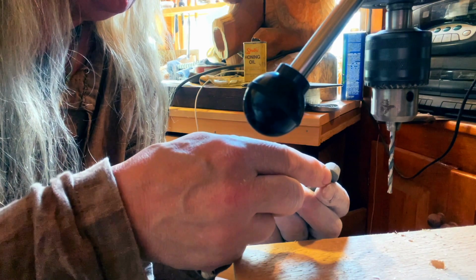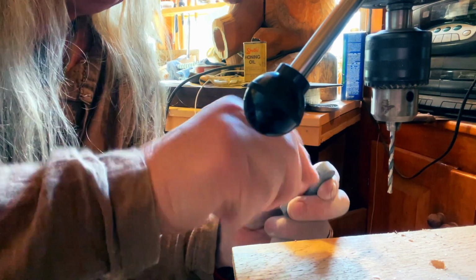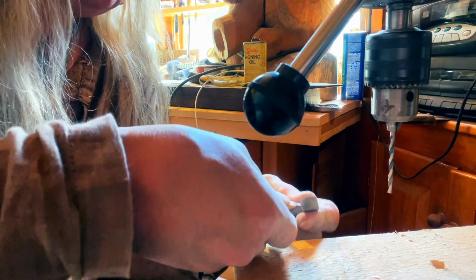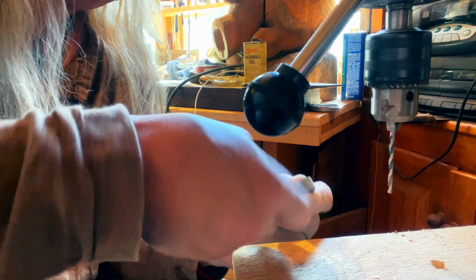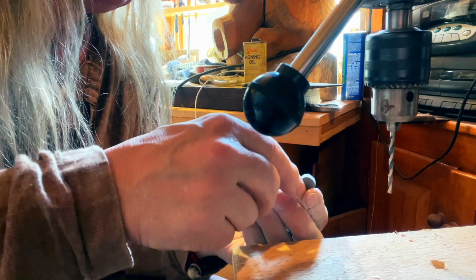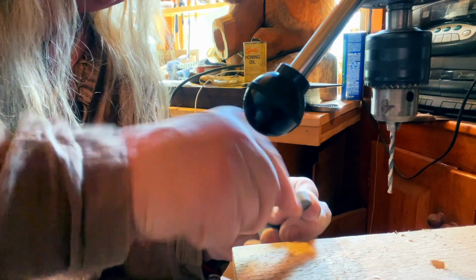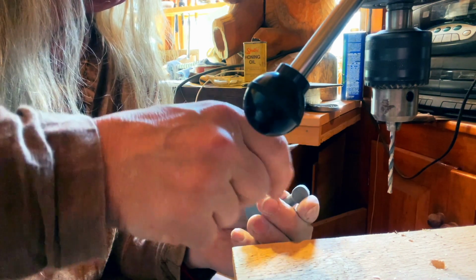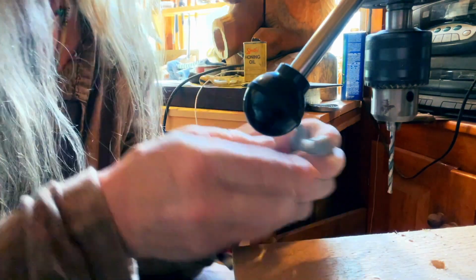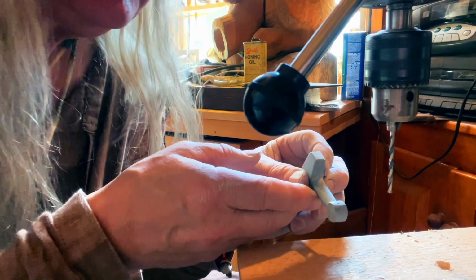What I usually do before I drill is make a pilot. With metal, I'd punch it with a punch. This is one of my scribes. This scribe is one that I save aside for stone. When I'm working with ivory and things, I rely on a much sharper tool, and I like to keep it sharp, and grinding it against a stone is not a good way to keep it sharp. If I kept at this, it would drill a hole in itself all the way through, but it's not what I want to spend all my time on. Does that show? I think in there you can see the little mark I've made.